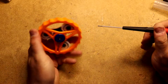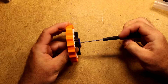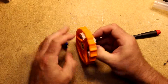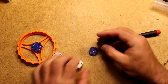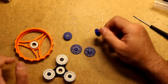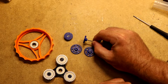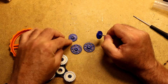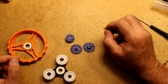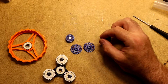So I modified it to have a bolt through the middle. There's a metric screw that loosens all the way. I took the sun gear and put a hole through the middle of it. I took the end caps, put a hole through them, and set this up for a countersunk M2.5 screw. Over here I put a heat set thread insert. I really like heat set inserts because they stick with the part rather than putting a nut in there. That got me away from those weak tabs that kept breaking or things getting loose.